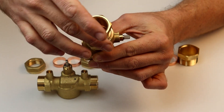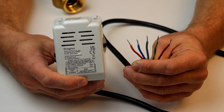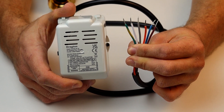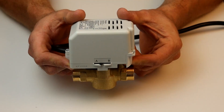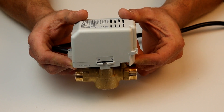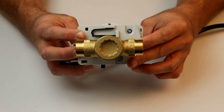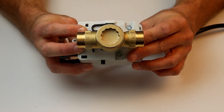As well as being larger, the 28mm body has female threads and male locking nuts. The ZA5 is a five-wire actuator and the ZA6 has an extra white wire, making it a six-wire actuator. These are interchangeable provided the extra wire is not being used, as is rarely the case. On the underside of the body the ports are stamped A and B, with the flow direction to be in on A and out on B. The port designation is diametrically opposed to the position indicator on the actuator, so always use the valve body markings when piping up.